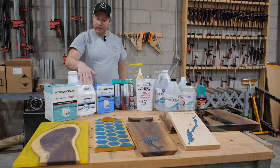If you want to build a coffee table or dining table with wood and epoxy poured up to two inches, you're going to want the SuperClear Thick Pour or the EcoPoxy Flowcast. For smaller boards up to one inch, the Flowcast SPR or SuperClear 24-hour is your product. For tabletop pours, finish coats, or shallow engravings, use the EcoPoxy UV-Poxy. The West Systems can also be used for engraving fills. The Akfix 5-minute epoxy in black or clear is great for slab work with smaller knots and fills when you want to keep working that day. And the Akfix 705 — you need that in your shop regardless of what you're doing.